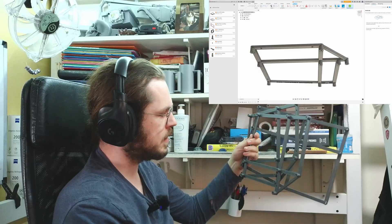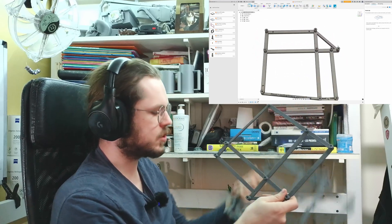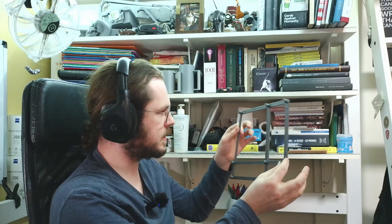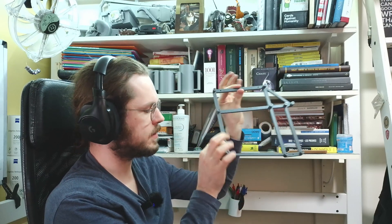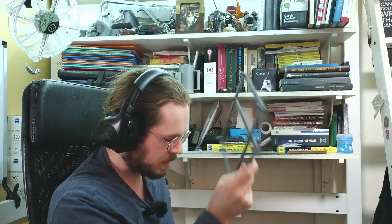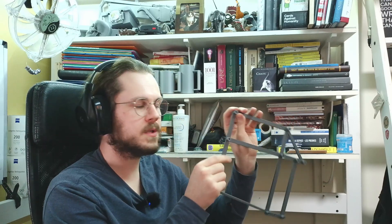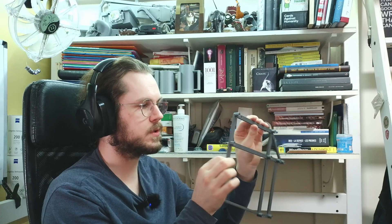With the exact dimensions and using Fusion 360 rather than TinkerCAD, I was able to do a few more designs that were already very promising. Here are a few failures: the first failed because I tried to use the same screw to go through the motherboard, the plastic support, and the aluminum back plate all in one, ending up with the same tolerance issues as before. Back to the drawing board — yet another version, much more promising, with its own holes to fix onto the aluminum back plate, using the original computer case screws to fix the motherboard onto it.